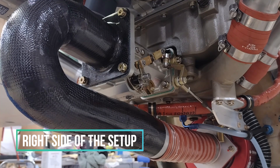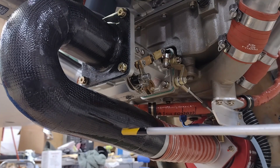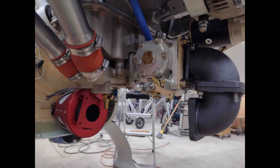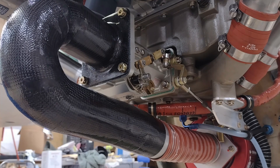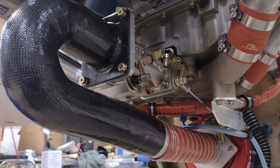Here we are on the other side. It doesn't look that much different from the left side. I will point out that initially when I put the fuel injection servo facing aft, I did try to put that 90 and 85 degree aluminum elbows in right here to see how those would work. The problem was I had zero clearance with the cowling — I would have had to grind off almost all of the square flange of the bottom elbow, and it just wasn't going to work. That's why I ended up being driven to create and model this thing and actually construct it.